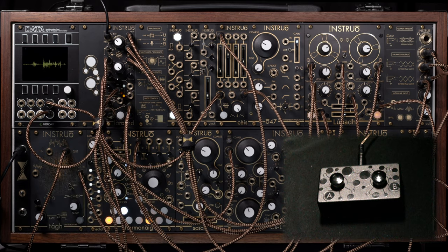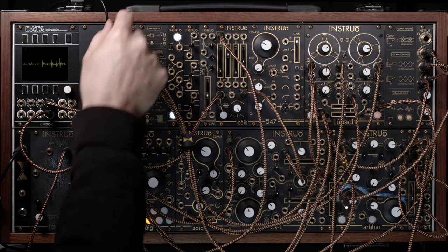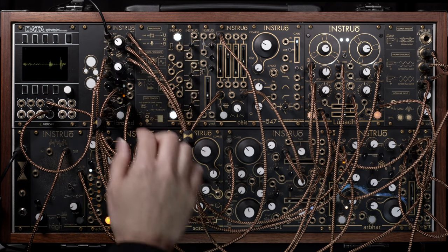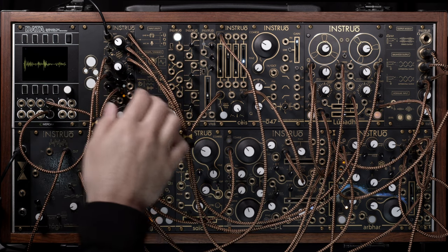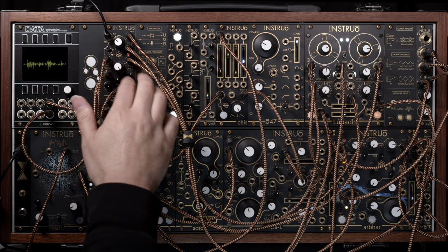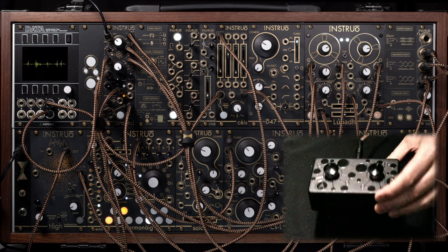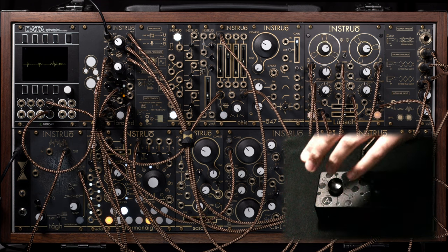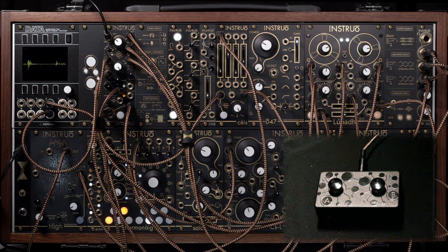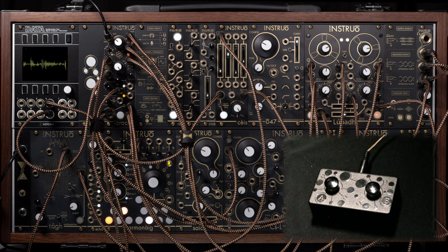You can see this patch is controlling a multitude of different things, and there's lots of ins and outs to this module. In a nutshell, we have a stereo line-to-modular step-up preamp stage, an audio enhancement circuit which adds a bit of wave-shaping and harmonic distortion, an envelope follower with variable attack/release, a threshold-definable gate, and a foot or hand controller depending on whether it's on table or floor. This gives you gates, triggers and lots of control, so you can be hands-free or remote over different aspects of a patch.